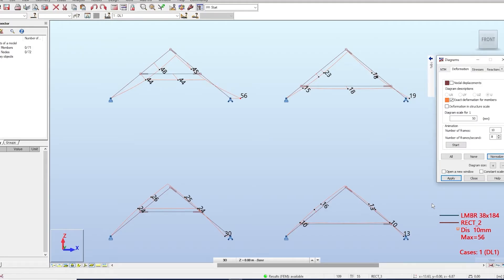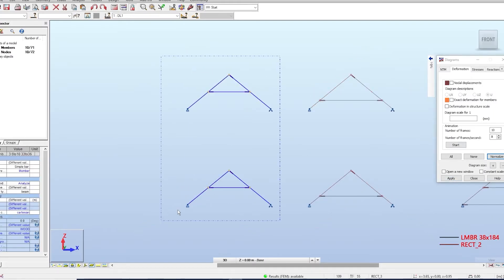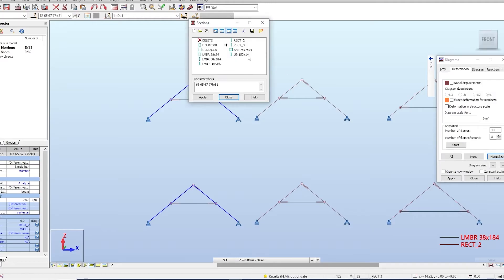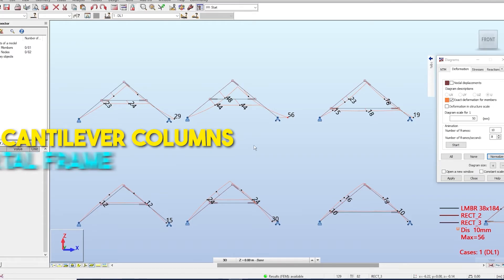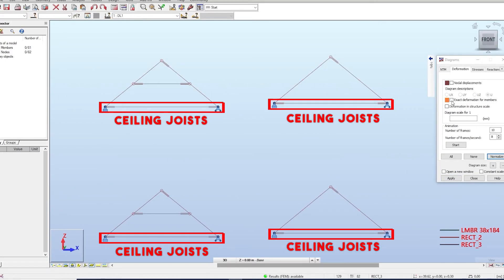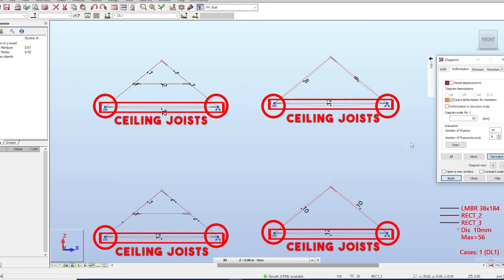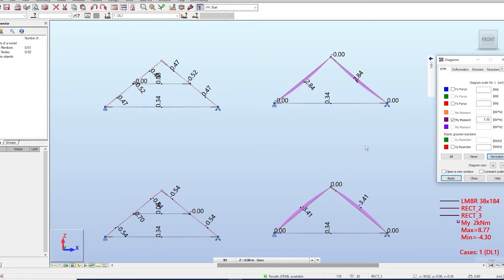If for any architectural reason the collar tie must be placed closer to the ridge of the roof, you have a couple of options. First option is to increase the stiffness of the rafters, which in most cases might not be the right solution, but changing the rafter to a larger section will drastically reduce displacement. The second option would be to use cantilever columns inside the framing or attempt a sort of portal frame action. With ceiling joists, there's no more lateral displacement because the ceiling joists are now tying the roof together and preventing the walls from spreading apart — which is the ideal case for timber-framed walls. The bending moment on the rafters also reduces a lot, and having both a ceiling joist and a collar tie is the most efficient system, resulting in smaller rafters.